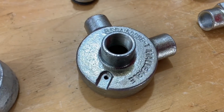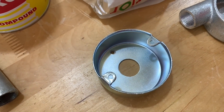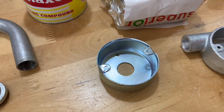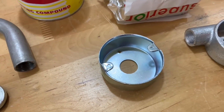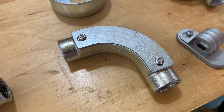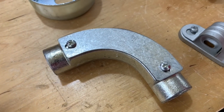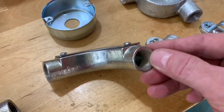Similar to the others, we've got an angled back outlet box. And just here we've got a one-hole looping box — that's where your conduit system may be going into a poured concrete ceiling, and you can have these with two, three, and four holes in the back to bring multiple conduits in. We've also got an inspection bend — similar to the inspection tee, the idea being it's a drawing-in point, and these are threaded.